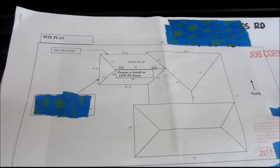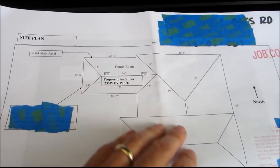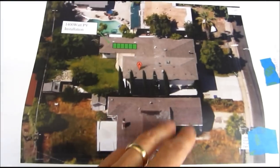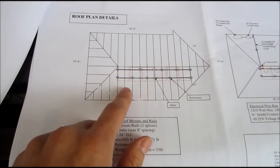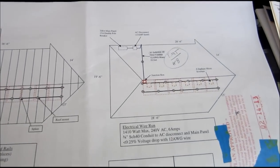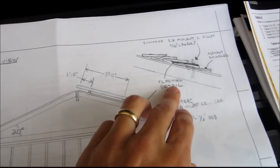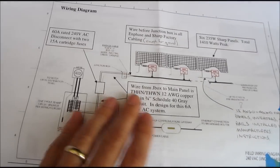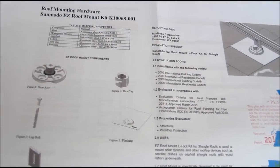After all that, you've got to create your plans. I did these in a couple of days — maybe one day actually. For the site plan I used Google Satellite and sketched it in Word. I put in where my panels are going to be and where my main panel is. I included an aerial view showing the panels, lines where my rafters are, and where the roof mounts will be — mine are six feet apart maximum. I also included where I'm going to run my conduit and the typical rafter installation detail showing the flashing. For the wiring diagram, I cut and pasted from the inverter website and added some extra information.